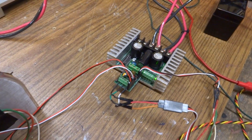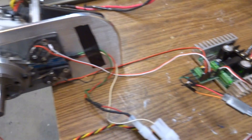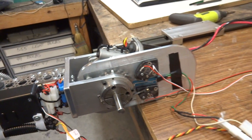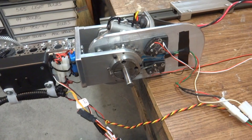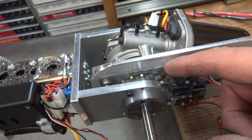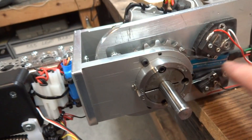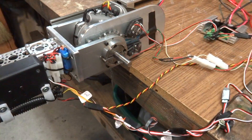The feedback and position control is by the little Kangaroo x2 right there. I have some limit switches here wired in, so when it reaches up and it hits one of those switches it's gone too far. But with the Kangaroo you don't really need those — I decided to get them and put them in anyway. That is an option. I have position feedback by a soft pot potentiometer — a little flat potentiometer that goes back behind here. There's a stylus screwed in right there that pushes up against that membrane and tells the Kangaroo exactly where it's at.